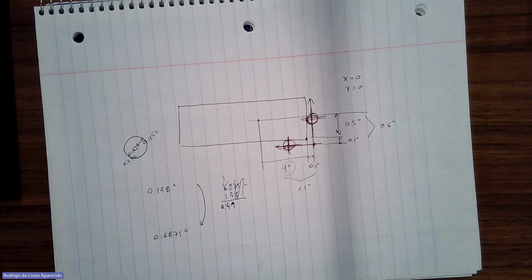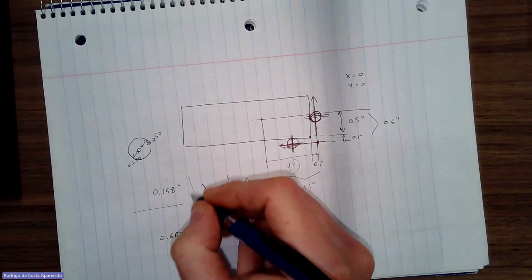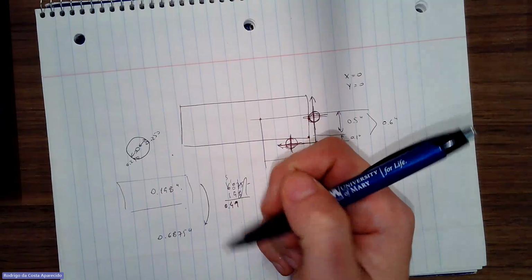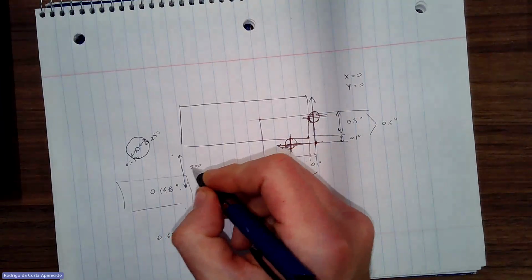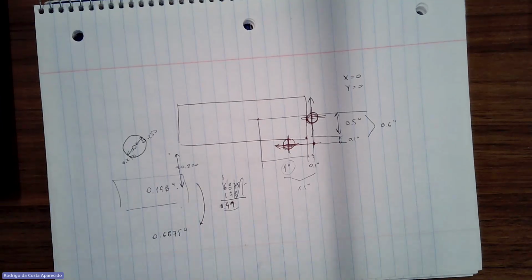But I wanted you guys to have a better understanding of the drilling operation. For the exercise, I'm going to give you another number here, just so we can do a center drill, drill 1, drill 2 levels. That's what we're going to try to do. We saw that from here to there wasn't difficult. Taking 200 thousandths, that means 100 thousandths on each end. It's not complicated, but now we're trying to take more than double of that.